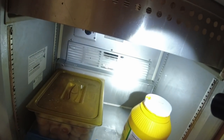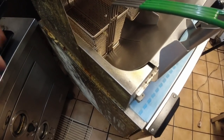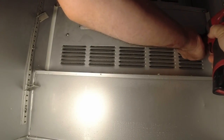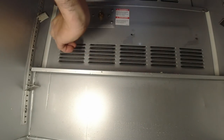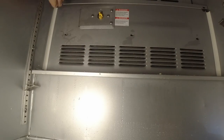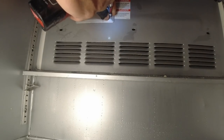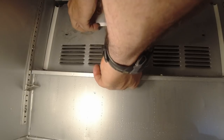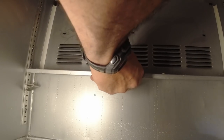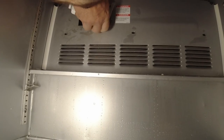This one over here — we're going to drag it out and get it melted out. Luckily they're not busy yet. It's probably low on charge, plugged condenser coil — same as it always is. We're using water to melt it out; power is off, otherwise you'd short something. Just to be clear, this is not an instructional video for homeowners — this is for the guys that actually work on this stuff every day.